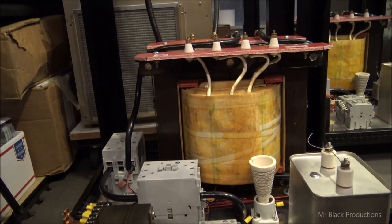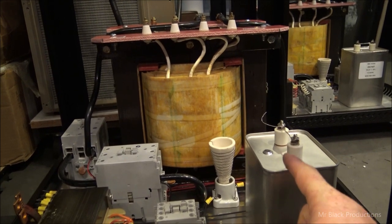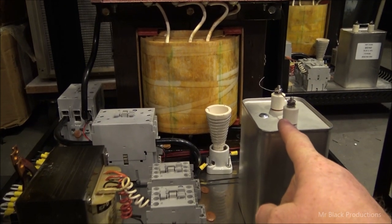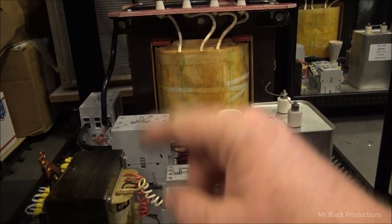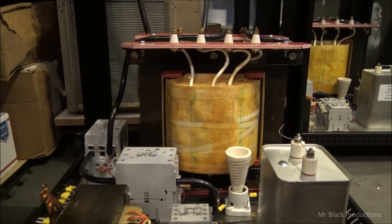Two, how we're going to mount down our high voltage capacitor, which is very important, because this has to stay fixed. This is like an electrical bomb. If we short these two leads together, with it being fully charged, we're going to have ourselves a huge arc and a big explosion. So we're going to have to mount this down firmly, and then I have to mount all that other hardware that I built somewhere in this space somehow.